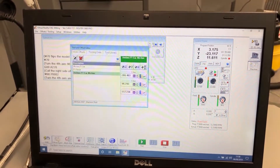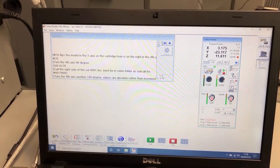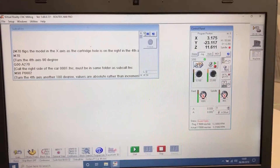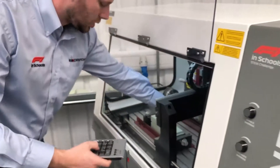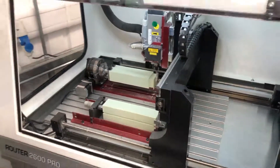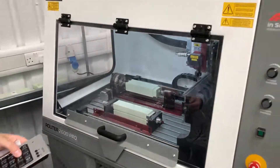We can now close the Offsets and Tools window, meaning the F1 4-axis fixture to manufacture an F1 car is complete and ready to run. We're going to go into Jog and back to the machine to move the tool away in X, close the door to move it quicker, and move it out of the way. That fixture is now ready, set, and ready to run.